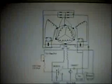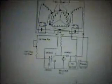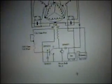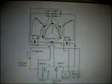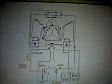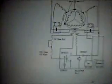And you can see, just coming off the 2 extraction coils, 2 rectifiers leading into the caps. On this I haven't actually drawn the 3rd cap, which is linked to the 3-phase rectifier at the top. It's not a problem to stick that in dead quick. Just a quick adaptation to the drawing. But there you go, that's your circuit. Okay. Put you back where you can see the Bedini.